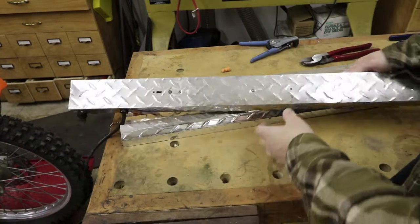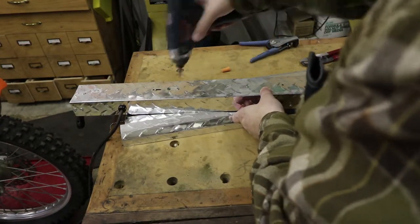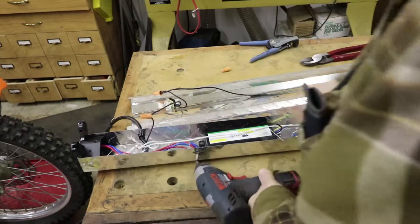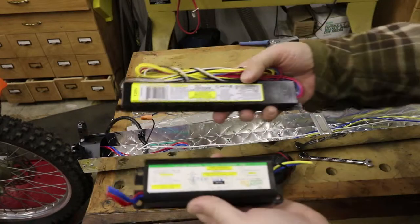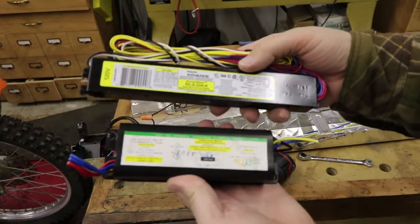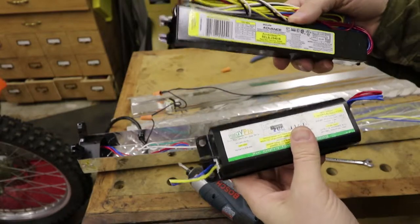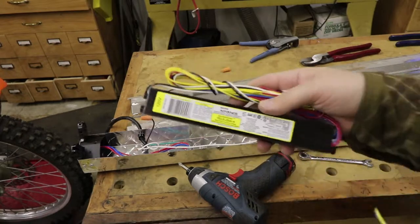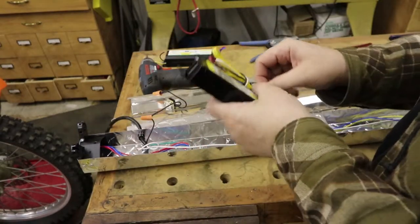Now my ballast is not connected to anything. On this light it looks like it's just a couple of screws holding it in. There are the nuts — they're probably going to spin on me. Alright, so there's my ballast. Comparing the ballasts, they are different shapes, but they still fit in here. This one feels a little heavier — I'm guessing this is a magnetic ballast and the new one is an electronic one, which means it should have better output in the cold, since these lights are in a greenhouse.